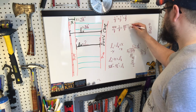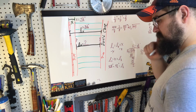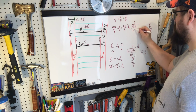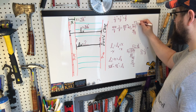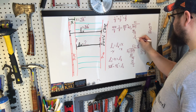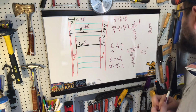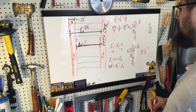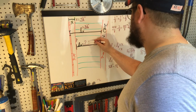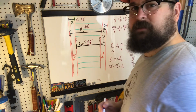We bring it down and divide it. So 8 goes into 415. I've done the math on this before, but okay. 5 times 8 is 40. Bring down the 15. It can only go in once, right? 1 times 8 is 8, and that leaves 7. So 51 7/8, which is a measurement on the tape measure. So I need to cut this board. The actual length needs to be 51 7/8 of an inch. All right, thank you.